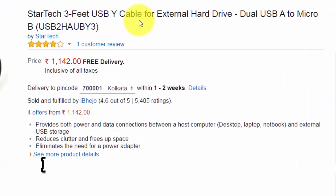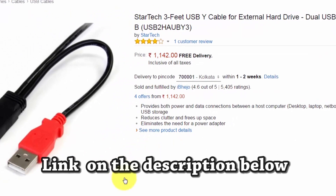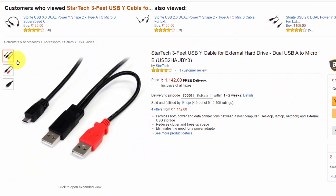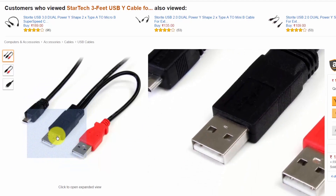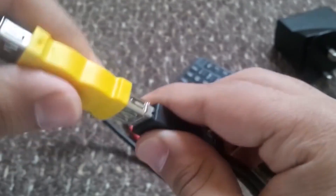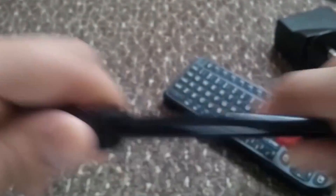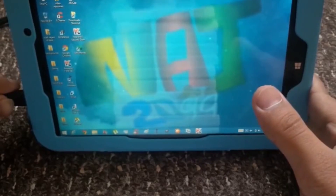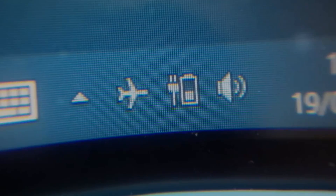Method 3: Static Y cable. You can buy this cable from Amazon and it costs a little bit more, around 14-15 dollars or about 1100 Indian rupees. The red cable is for power and the black is for going to the device you want to connect, and the small one is the OTG connector. You also need a female-to-female USB connector to connect your USB devices with this cable. Put the power into a power bank and your device starts charging.